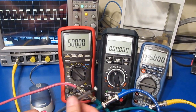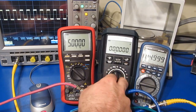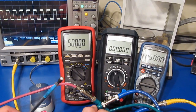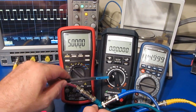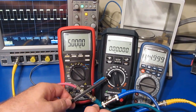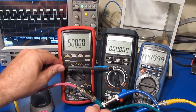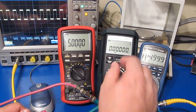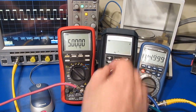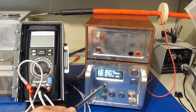How come this meter isn't able to read this right now? It's because I took the magnetic hanger off of our little cheap meter and waved it behind this meter, and I don't have the shield installed right now - this meter is basically back to its original factory condition. The relay could be in the wrong state and in AC volts mode the meter could be reading 4 volts or less with a 120 volt signal applied. That also holds true for the frequency input - the relay could be in the AC state and you could be trying to read frequency and it's going to read zero. To change the state, switch the dial - you can hear the relay switch - go back to frequency, and there's our 5 kHz.